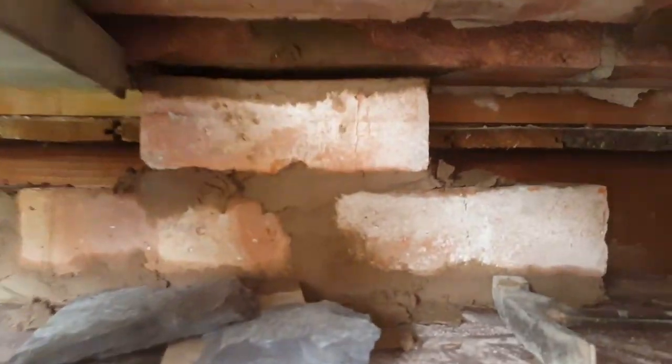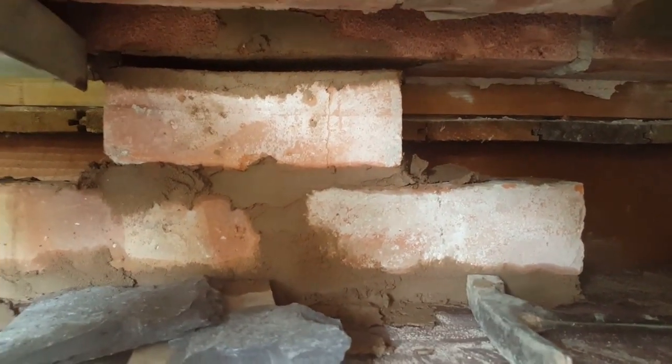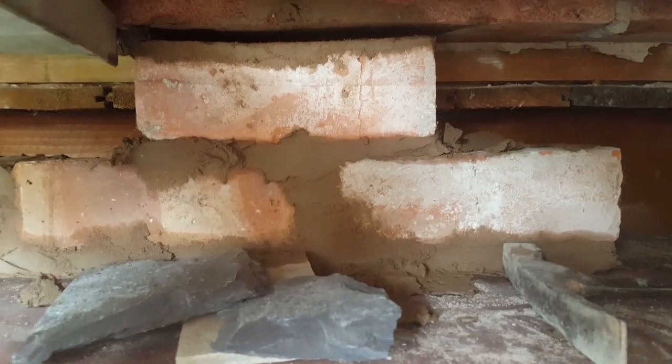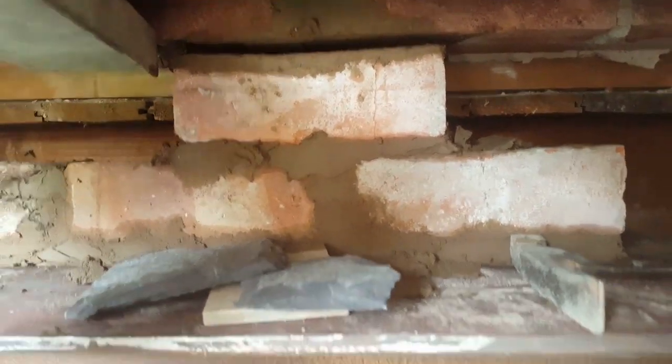The key to it is packing all the cement mortar into that gap. This is where you get a few cowboys — they don't care about it and just fill it. You've got an inch gap and the whole house is resting on just a bit of poor cement rather than a decent mix resting on the steelwork.